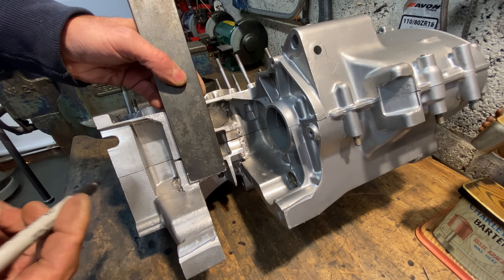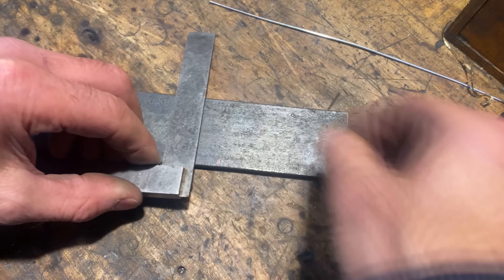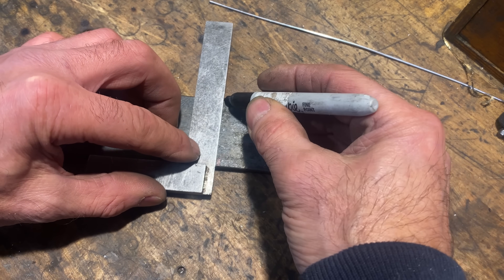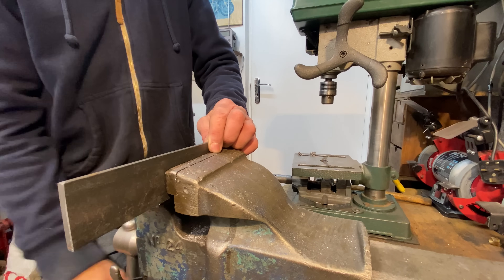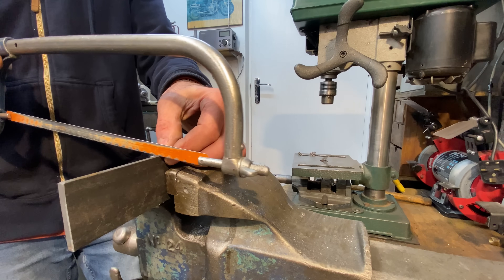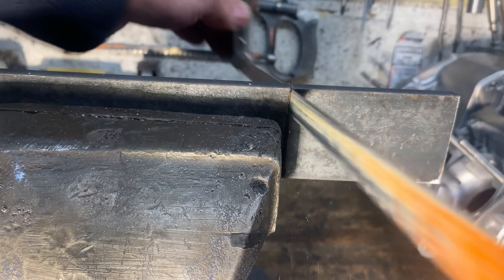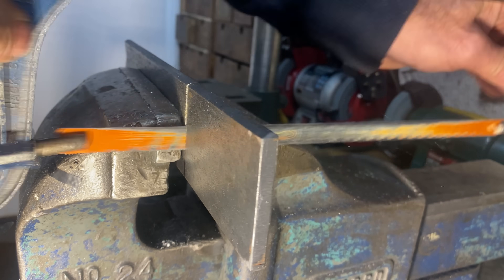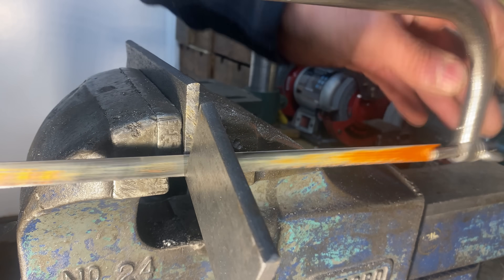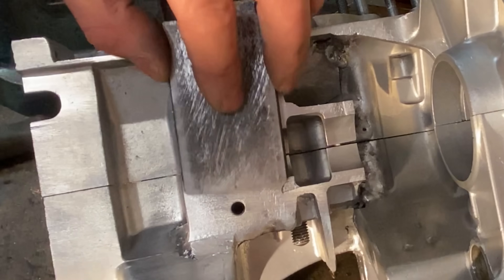With the surface filed smooth, the next thing I need to do is make the outrigger support bracket, and I'm going to use quarter-inch thick mild steel strip for this. I mark out the length and put it in my vise to use my hacksaw to cut the piece off. I get so many comments about how I cut straight lines with the hacksaw, but it's quite straightforward — the trick is not to force the blade through the metal, let it cut slowly and guide it as you go through.